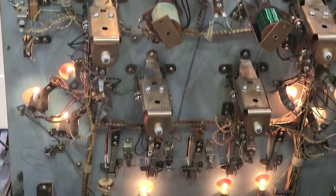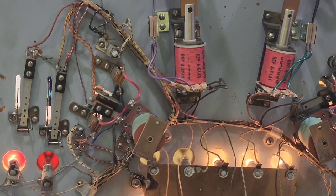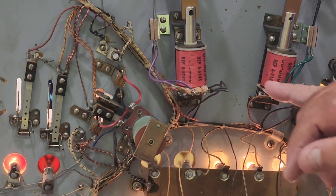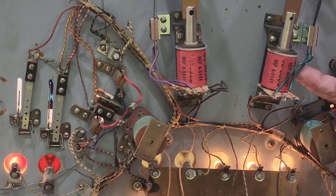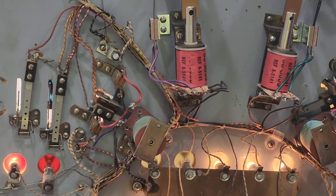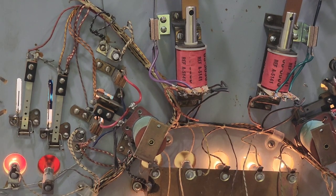On the flippers - there are the flipper coils there. The wires were just sitting in there. Someone's gone to the trouble of putting new flipper coils in this at some point, so we've re-terminated these wires with that green wire. Normally they've got that purply-coloured one because the old wires are a bit oxidised, and they were soldered incorrectly. The flippers would have barely worked. We did also put a flipper kit in as well - so that's all done.